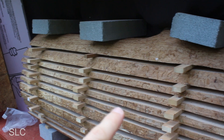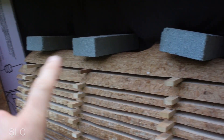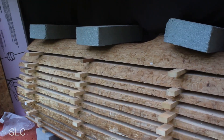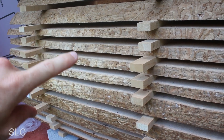If you've never done this before, you might be wondering why I have concrete blocks on top of the wood. As this wood dries, it will have a tendency to warp and twist, but putting this added weight on top deters that — so hopefully by the time it fully dries, it'll dry flat. It's not perfect, but it does help.